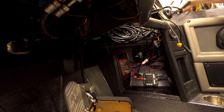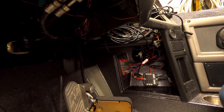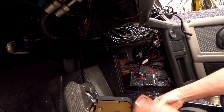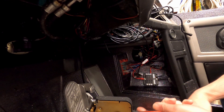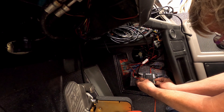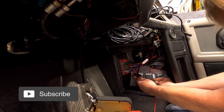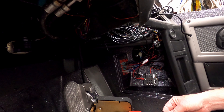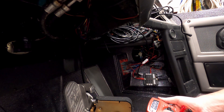Let me get these cables out of your way — these are all the console cables. They'll get labeled and sorted out in a moment. So first thing we're going to do is take our handy dandy volt meter. We want to check between these two lugs to make sure we've got 12 volts. We put the meter on a 20 volt scale. Put it on positive, put it on negative, and we're showing 13.01. So we know our fuse panel is good — we're getting power up there. If I go to the bow, I can also check and see if my network box is turned on. I did that a few minutes ago and yes, indeed, it is turned on — you look at the power light. So we're pretty much good to go. This is a major hurdle in the installation — actually having power and working power.